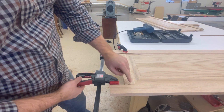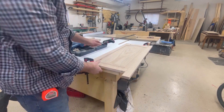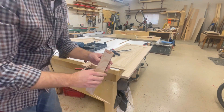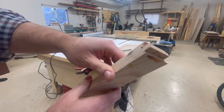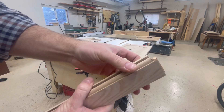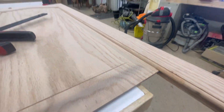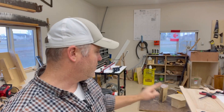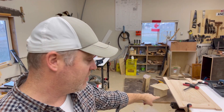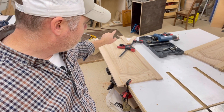Well, it broke the other side. This side seems to have moved a little bit, but that side definitely broke. Oh, look at that — this side that there was no heat on, it broke the wood. This side there's a tiny little tear-out, but on the whole it actually hardly any damage at all. I would say that's completely salvageable. I'll clamp that down and heat up the other side to see if I can get it out as clean.